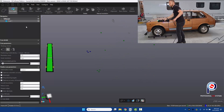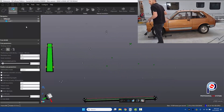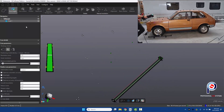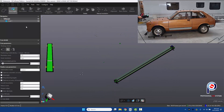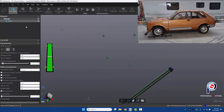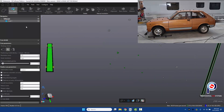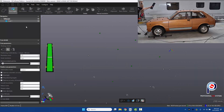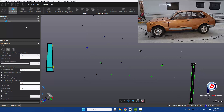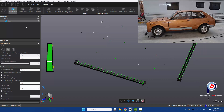As I come down you can see the bars starting to appear, and the more I go over it the better the result will be. Right now it's got a bit of red and now it's gone fully green — that means I've acquired the scale bar in enough directions for it to register properly. On the left-hand side of the screen there's a distance meter. If I'm too far away it will go blue; if I'm too close it will go red. You just want to get within the green range.